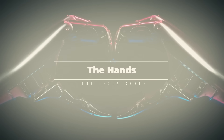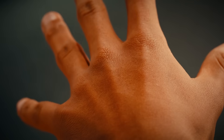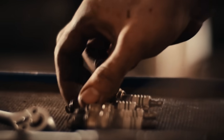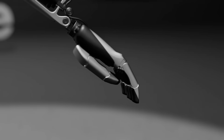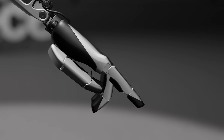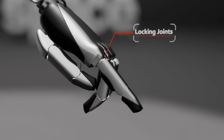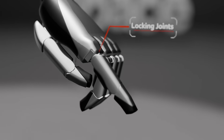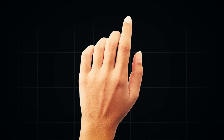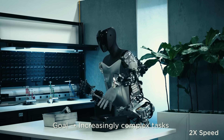The hand of the TeslaBot is designed to be as human-like as possible, because the world is already designed to be ergonomic to the human hand — there's no point fighting against that. The human hand is also one of the most amazing products of three billion years of natural evolution. Just like in nature, the TeslaBot's fingers are driven by metallic tendons pulled by the smallest series of actuators. Each actuator has a built-in clutch to prevent back drive: when the finger is contracted, a mechanism locks it in place so it can't spring back, meaning the actuator doesn't have to constantly pull against the weight being carried. When the bot wants to release, the clutch mechanism disengages. The only human feature the TeslaBot still lacks is the middle knuckle — Optimus fingers join at the hand and fingertip but don't have the pivot point in the middle that allows a tight fist.